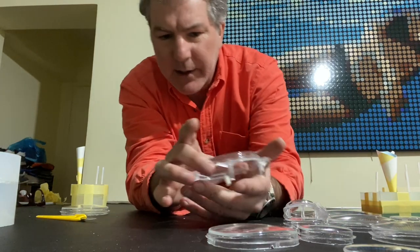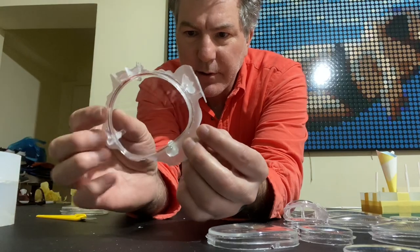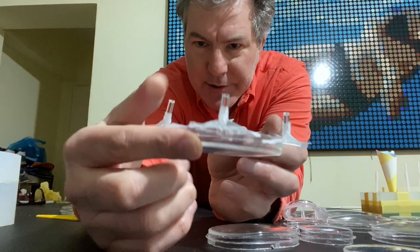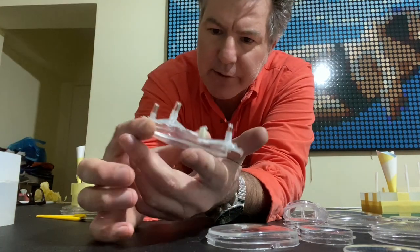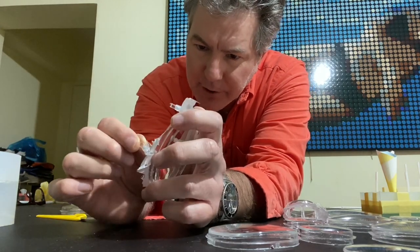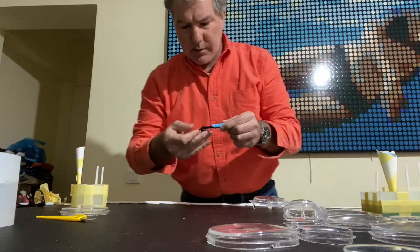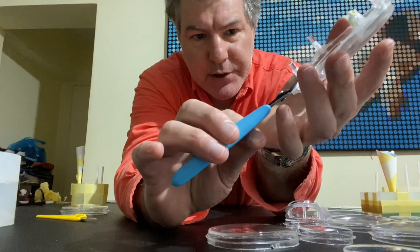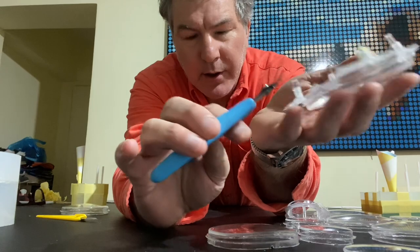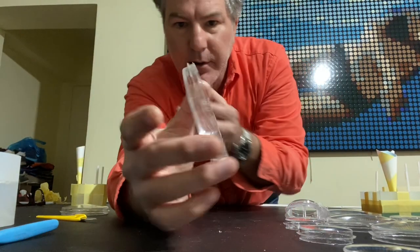Once lenses come out of the mold they don't come out ready — you have to deal with flashing. You need to trim the vent ports; you can see them here. I let it cure for a few more days until it's hard, then I use precision pliers — the ones that came with my 3D printer — and very carefully trim the flashing and ports off on the edge. Then you get the final product like this, where everything is trimmed.